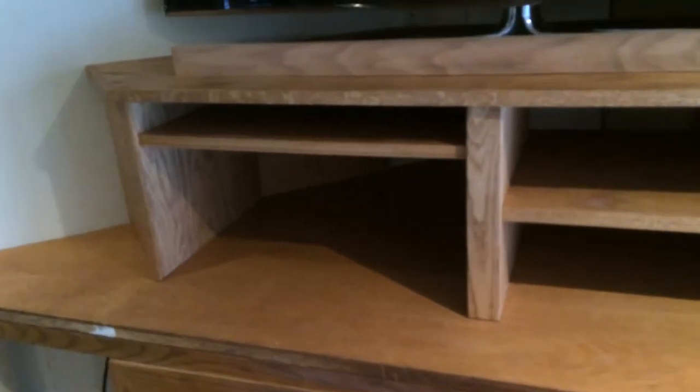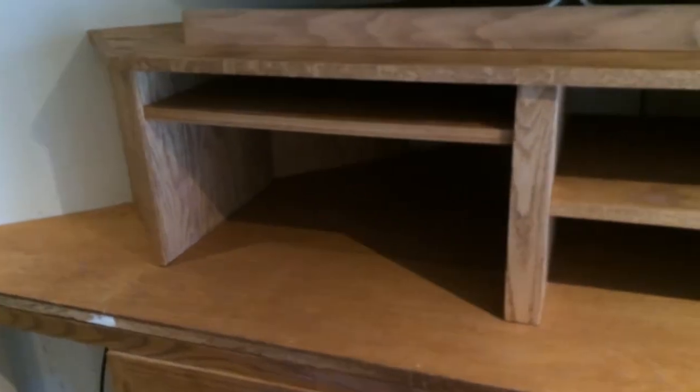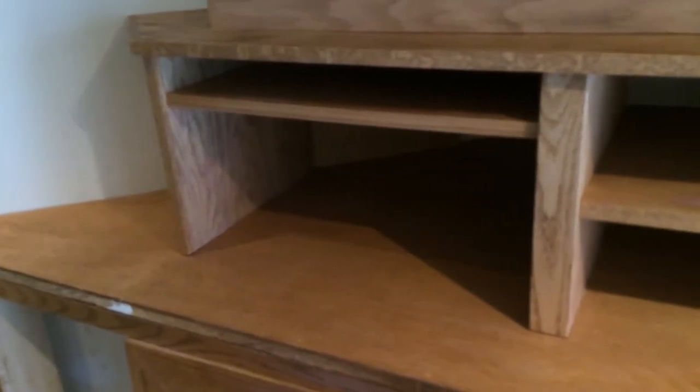One of the things I had to contend with - I glued down this piece of oak veneer plywood and there was really no good place to clamp it other than along the front edge. I used my brad nailer to try to hold it down and put a bunch of weight on it, but I put way too much glue on there and developed a hump midway through the center supports. The back thing rocked back and forth, so I spent about 20 trips in and out of the shop trying to match that contour with my block plane to hollow it out and make it fit. I probably could have put some rubber bumpers under there to compensate, but I really wanted it to sit tighter to the top - and amazingly it's still level.